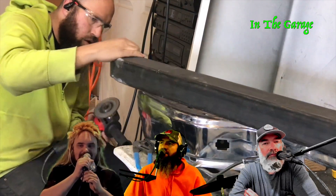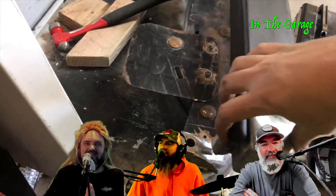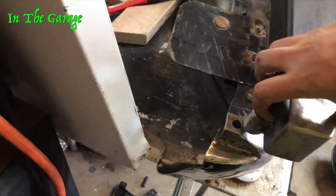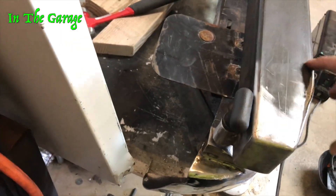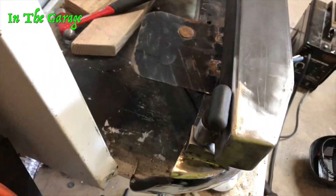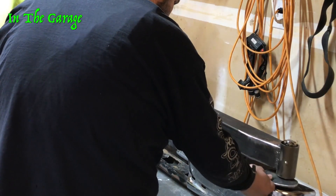Here it is finished — smooth like butter. It closes right when there's weight on it, though without the weight I have to pull the T-handle up. The bump stop isn't in place yet for that. So then we got this piece of metal that's going to hold the swing-out open at different stages. We're going to weld it on, drill two holes in it, and put a pin right above where the thumb is to hold it open at different angles.